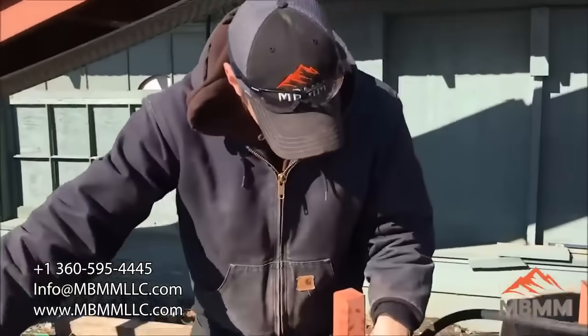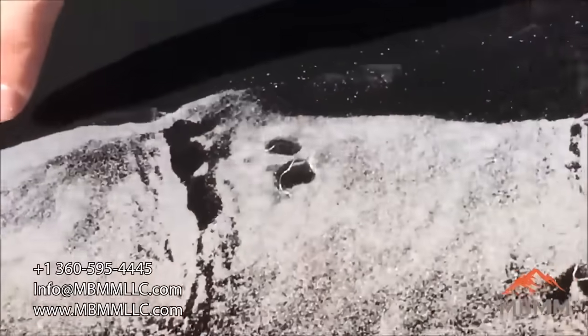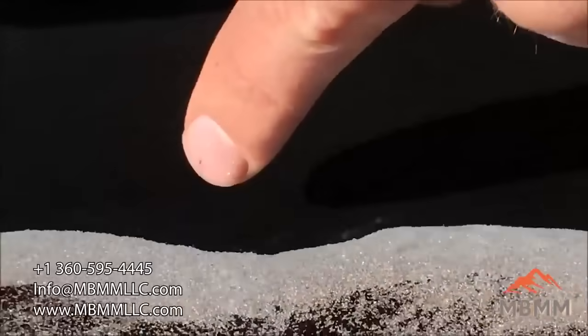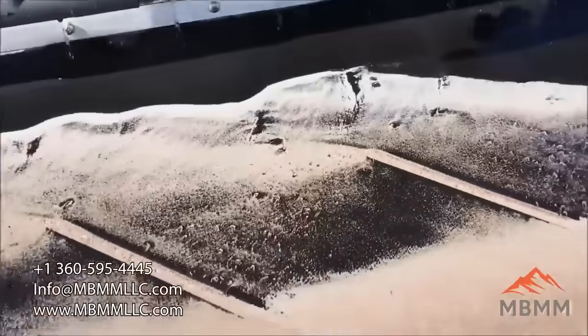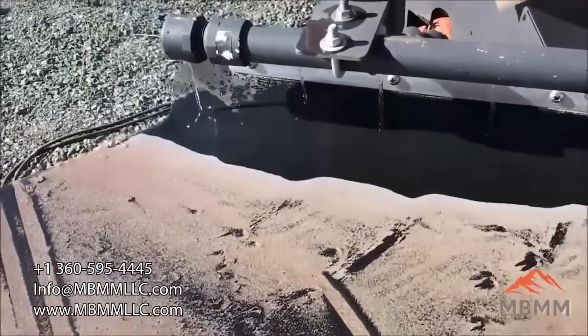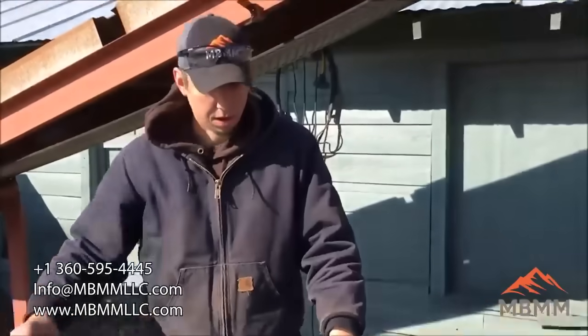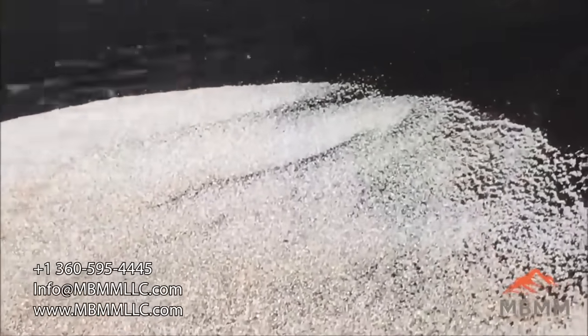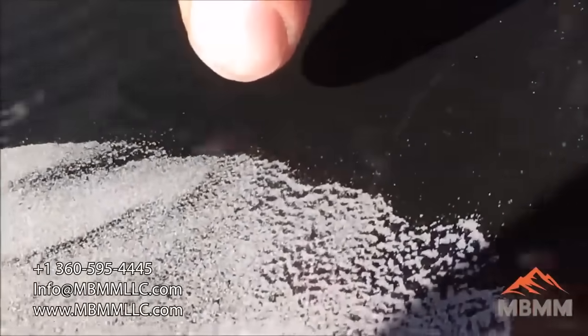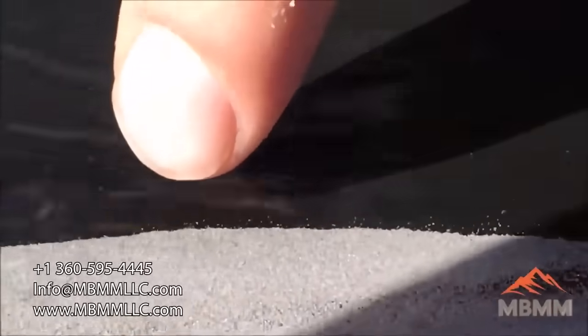This is our second sample — we're just about finished running. Right along the leading edge, there are little tiny pieces of gold all the way down here going into the number 1 port. That gray silver band is probably lead or tin solder — maybe it's a silver solder, I'm not sure. But the gold is right at the leading edge of that because it's the most dense, and it's working its way right down into the number 1 port. It'll be interesting to see what the assays are from these samples and see if we're recovering most of the gold in our number 1 port. When you brush down the table you get your best showing of gold, and you can see right along the leading edge of this gray stuff there are gold pieces coming all the way down there.